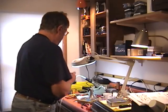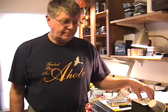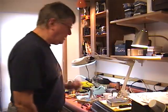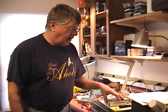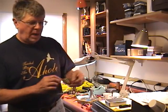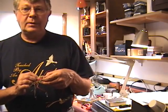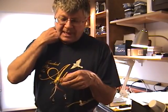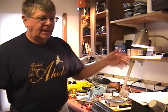I suggest if you're going to build this kit, or obtain your own parts however you do it, double-check everything. Check all the resistances with your VTVM or digital multimeter. You need to obtain your own enamel double-covered 22-gauge wire to wind the toroid. I bought a pre-wound toroid for $1.39 or $1.99, unwound it, and used that wire — which left me with a lot extra.